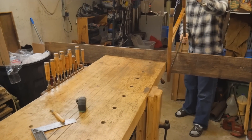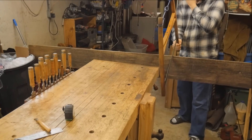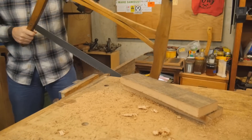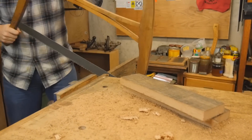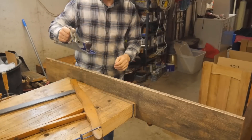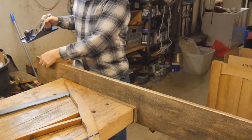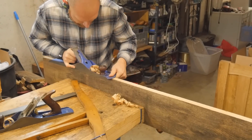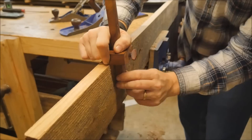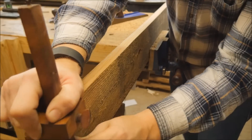This is white oak — one of my all-time favorite woods and a pleasure to work with. I need to cut it to length and start taking it from rough sawn lumber to usable lumber. This bow saw is something I purchased a while back and I love using it. Once they are cut to length, I need to joint one edge so that I have a surface to reference off of and to make future marks. I use a number seven plane to get a perfectly flat, smooth edge all the way across, giving me an edge I can make a mark off to find where I need to cut next.